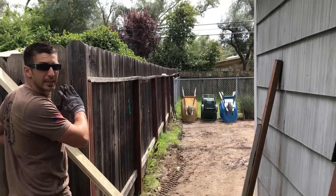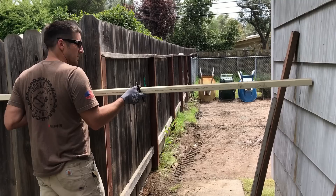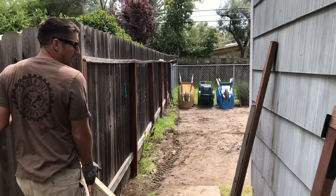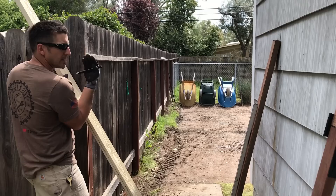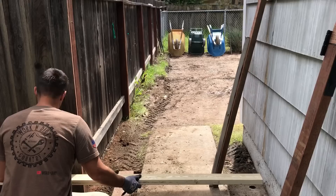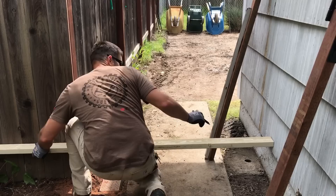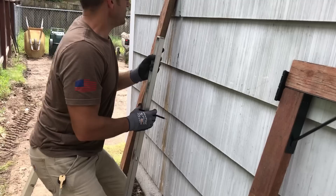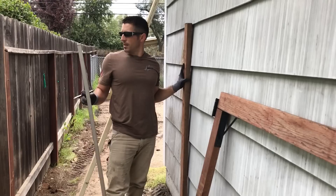We are making sure that our gate is on the same plane — we want this to be planar. So we're going to use a nice straight board across the surface of this fence, make a mark on the house, and then use a level from that point. You always want to double check this, because if it's not level front to back you could have a situation where the gate is shutting on a different axis. It's leaning forward a little bit, so we're going to cheat this kick plate forward a little bit so that it shuts better and looks nice and even.